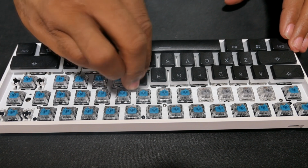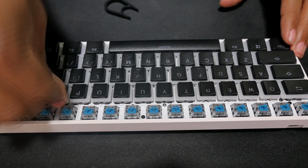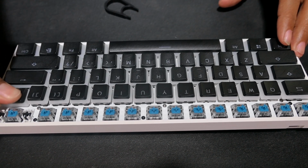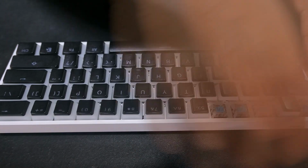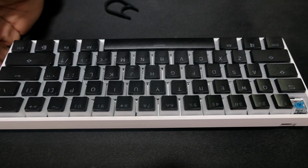After the PCB, you have what's called the base plate, or the plate. That's what the switches actually plug into; it holds them and everything else in place. Along with the plate, you're going to need stabilizers, and those are for your longer keys, like the space bar and shift, where the key is a little bit longer, so it adds stability so you're not wobbling to and fro.